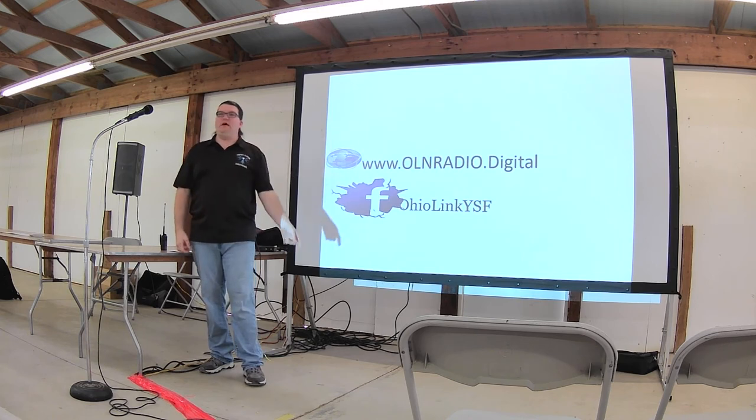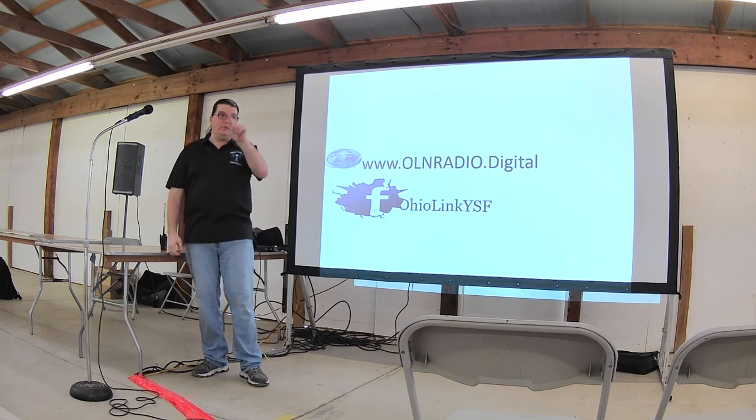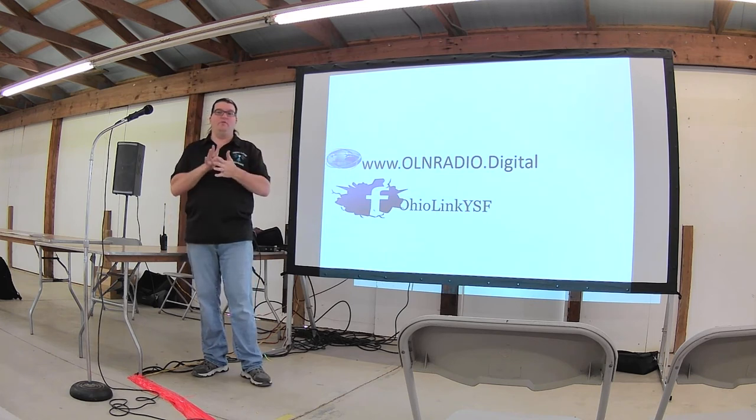That also lets you know that, for instance, you can go from Cincinnati to Toledo in an entire conversation. Now, mind you, you do have to change frequency to the area repeater, but you can go from Cincinnati to Toledo and still stay in the same number, given that the repeater or node gateway you're on is in the network. That's why we try to push for the folks in OhioLink to stay part of it. If they're not on the list but they're a Wires-X, they come and go, and we can't guarantee that they're going to be in there.